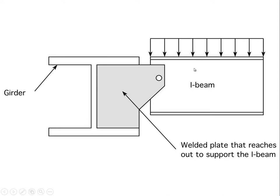And those bolts actually are stress risers that create stress concentrations around the bolt holes. And in spite of all of that, that's more than an adequate connection. In many instances, a single bolt of reasonable size is adequate to make the connection. So this is an example of how we could do this.